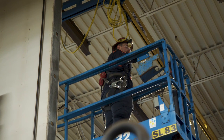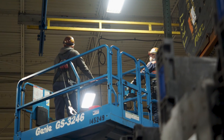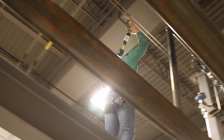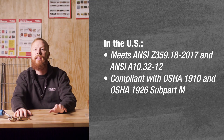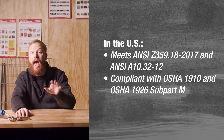Here are a few quotes from some manufacturers: 'Do not apply shock loads. Always lift gradually.' Another: 'We haven't designed our products with fall protection in mind. We do not recommend our hoist ring for fall protection.' Some manufacturers do not specifically advise against it and have instructions on how to use their product in a horizontal lifeline assembly properly. There are lifting or swivel anchorage points that can be used for fall protection. When looking for a swivel anchorage point for fall protection, you need to look for points that have been designed specifically with fall protection in mind and comply with the applicable standards.